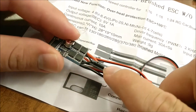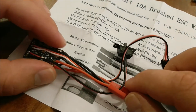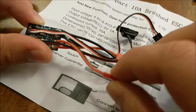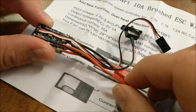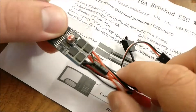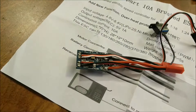If the switch has to be closed I'll just toss a solder blob on there. It comes with a capacitor just to filter the power supply - I'm going to take that off and it should still work. There are two leads: the outer lead is for the battery input on the female connector, and the inner two are for the motor output. I'll probably just disconnect everything and direct solder it all up in order to make it fit.